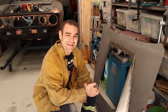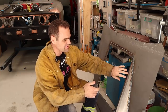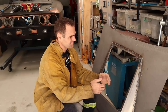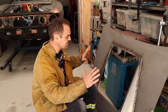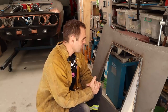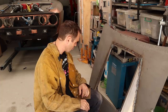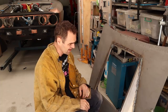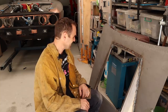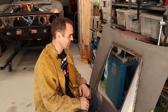All right, that was a lot of welding. I ended up doing it with the MIG because there were so many gaps. It wasn't very clean. And on these internal corners, the whole bonnet has sunk and warped in. So this is going to be the fun bit of A, grinding it all back, and then B, trying to flatten it all out again and get it looking good again, because at the moment it does not look good. So I created a lot of work for myself, so let's start tackling the grinding. Yay!